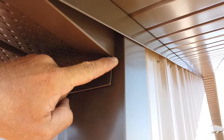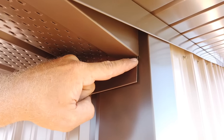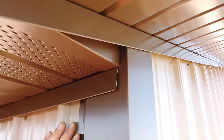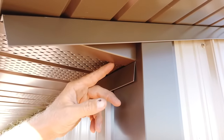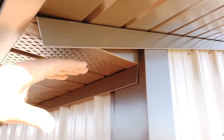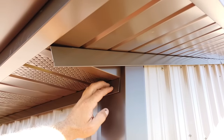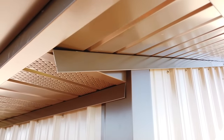Here's the detail up at the soffit. You can see right where we've got that three-quarter — see how that tucks into this soffit J up here real nice. And then that 112 dimension is cut right underneath to go in here, so it's a real nice tight connection. No wind-driven rain is going to make it that way under the soffit. And over here you've got your 4/12 pitch that we put on up here nice and tight. I think it really cleans it up. I'm not a fan of a bird box — on a one-foot overhang there's definitely no need for it. We would do the same detail up until about a three-foot overhang. At three foot this will terminate into a piece of trim and then we'll run our steel over. If I get the opportunity to show you guys that in the future, I will. But this is how this goes together — let's go ahead and wrap it up.